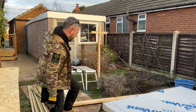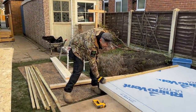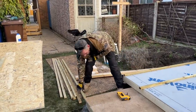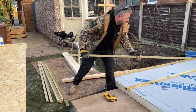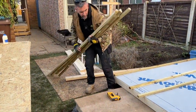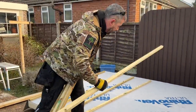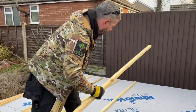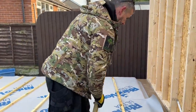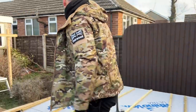I've cut these slate battens — the final cladding will be vertical, so to have double battening we need vertical then horizontal, then vertical cladding. The first row I've already cut to length — the same length as the OSB sheets. Everything's written out in the build pack; it's 13 different sizes and you can adapt them. We're fitting them with 90mm nails.